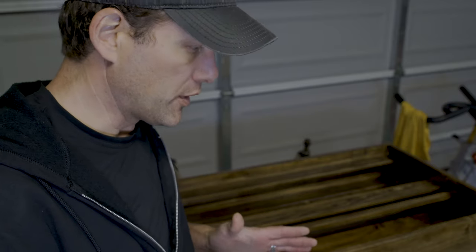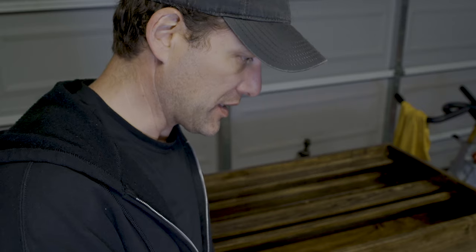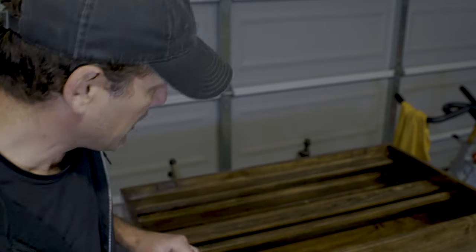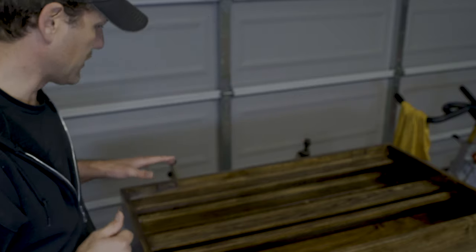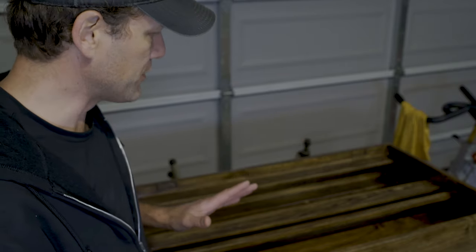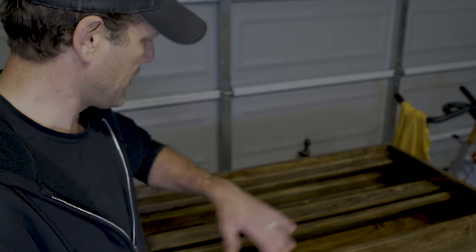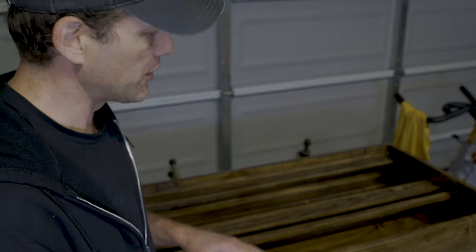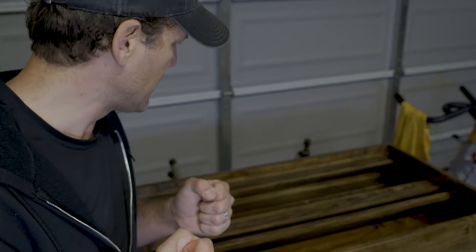That is one full coat on one side of the desktop, on one side of the light bar, and on all of the sides of this. In 2 hours, we get one more coat on this, maybe two, depending on how much shine we like. And then I'm going to hit it with some 220 in between. Well, I'll give it three. They're all gonna get three, okay? They'll get three! Well, you wanna just go and get it done, right?